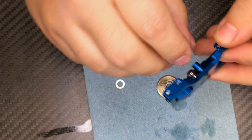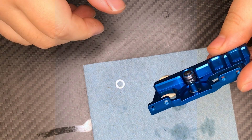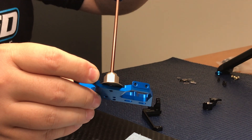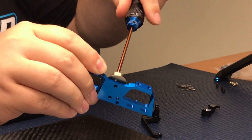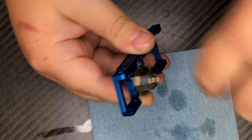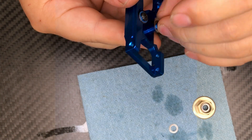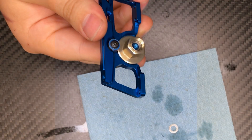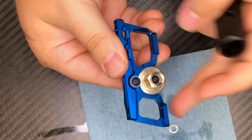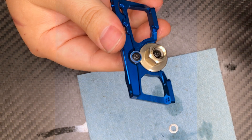Take the shims off of your motor mount. Typically this is going to need somewhere between 0.1 and 0.2 shims. I left that 0.2 shim on there — take the center pulley hub and when I tighten this down it should spin free if the bearings are pressed in all the way. That's a little tight, so I'm going to put the 0.1 shim in instead. There we go — you can tighten it down, it spins free. The point of these bearings being pressed in is so you have very minimal play on the pulley hub and your spur gear stays true and doesn't wobble.